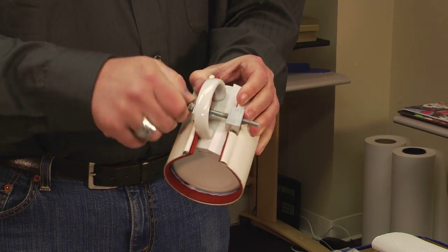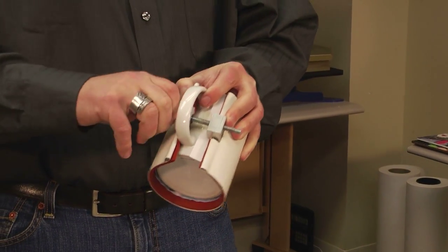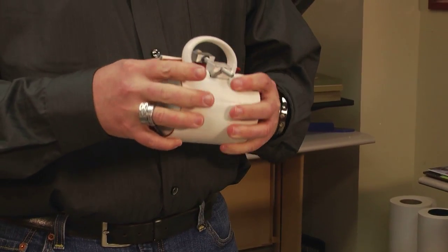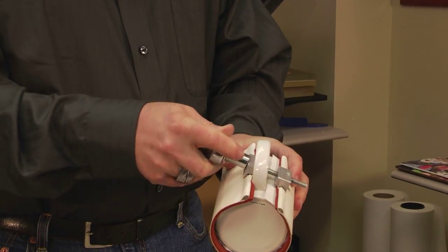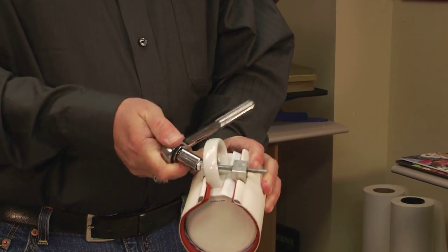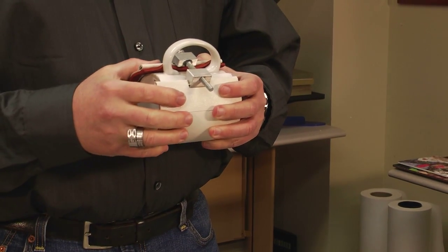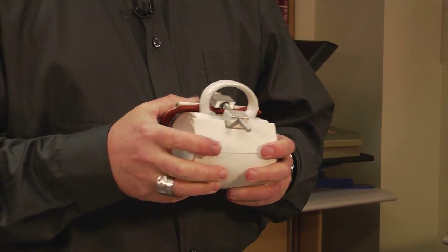And yes, we're going to finger tighten every single time, unless we have a special tool, which is a mechanical screwdriver with a clutch, which I'm going to demonstrate in a moment. After we finger tighten, we then turn 2 full revolutions. That's 1, 2. That's all. 2 full revolutions. You can use a crescent wrench or you can use a socket wrench, whatever you prefer.